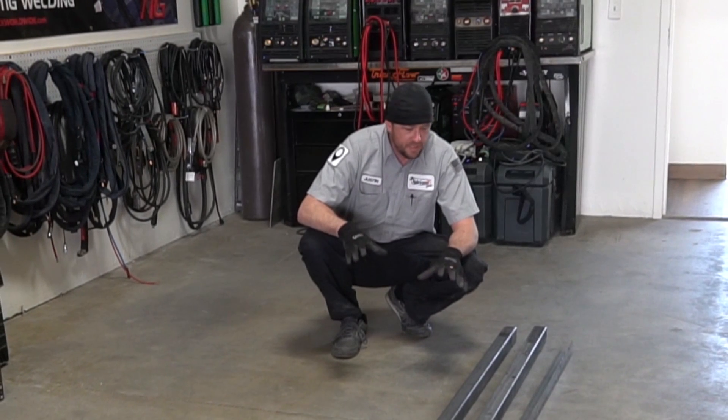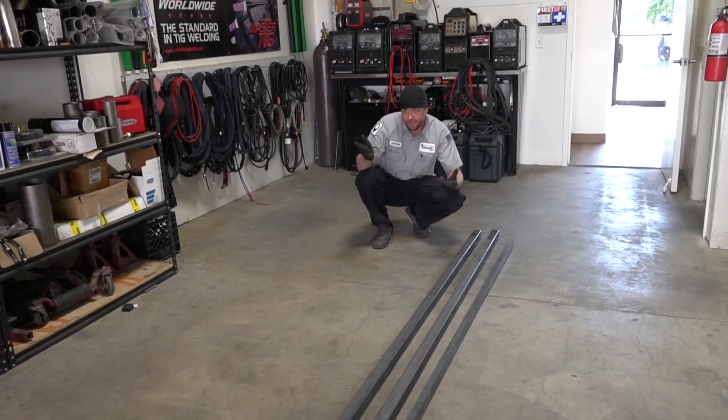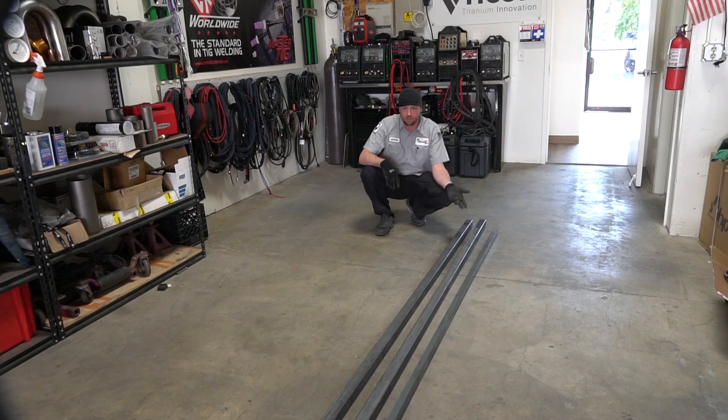After only a couple of minutes of digging through my scrap pile, I found the pieces that I need. It's a little bit overkill even though the thing weighs like 800 pounds. But this is two-by-two box tubing with an eighth-inch wall — that's more than sufficient. But I don't have enough to do all the cross sections. So after a little more digging and some quick math, I found some eighth-inch angle iron also in two-by-two which I can use for a cross section. We'll see how I like the design and what I want to do with it.